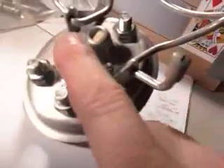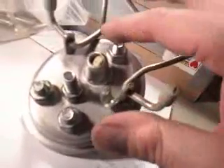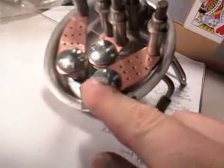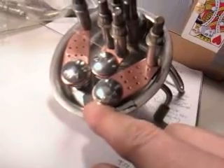Right now we're using steel bolts — actually 3/8-inch. This is what the top looks like here. The center one is going to be the longest at 2 inches; these are all inch-and-a-half length, 3/8 carriage bolts, four of them. In the future we're going to be using copper for a better connection — not dissimilar metal — so everything's going to be copper: copper washers, everything. For now we're actually going to solder the galvanized steel onto the copper to make a good connection and keep moisture out to keep it from corroding. That's what we're doing for the buses.